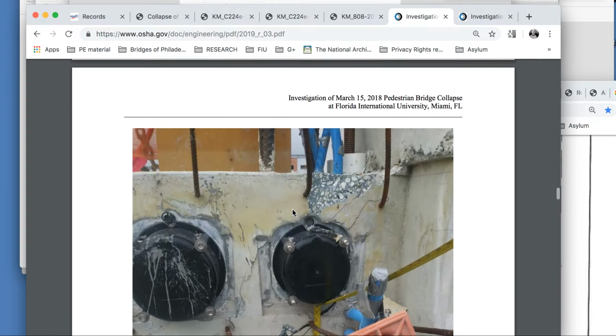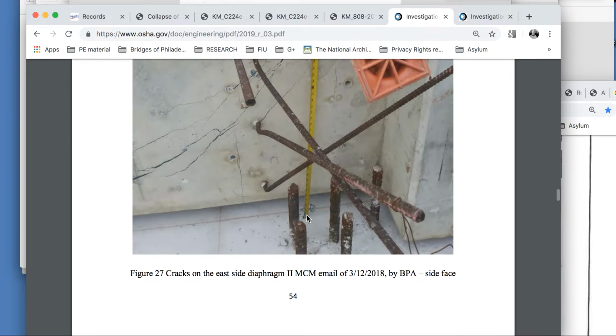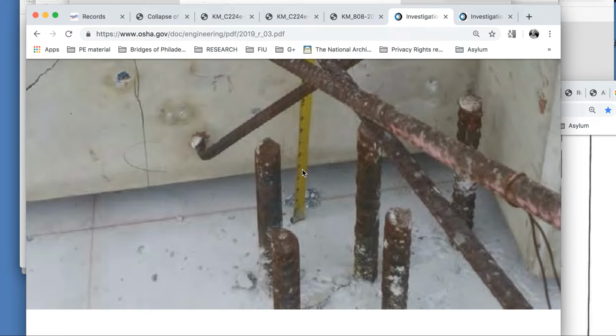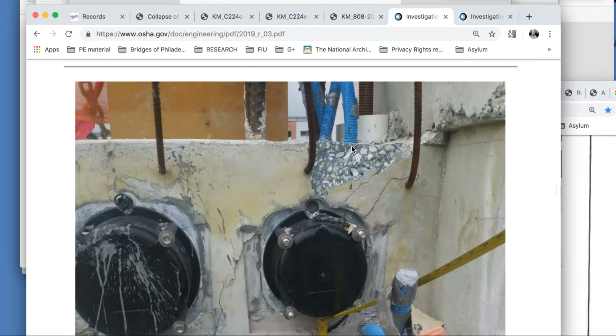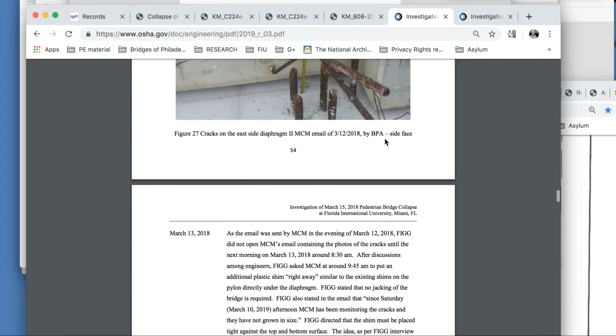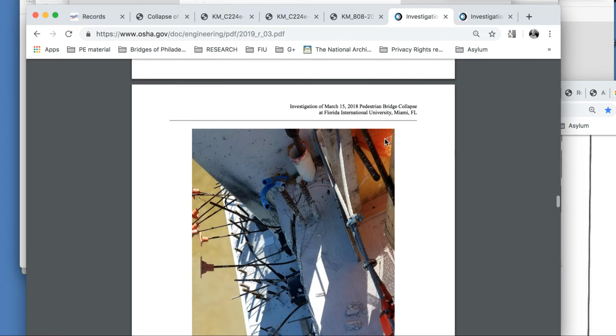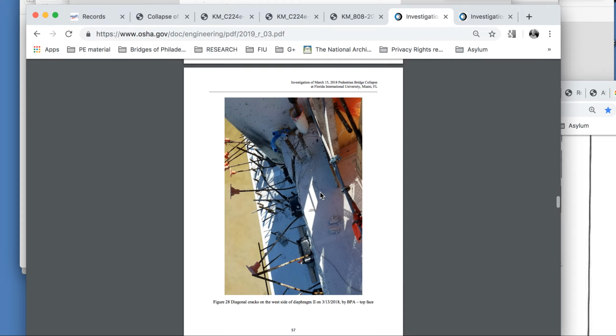It's shearing down and being pulled back by the tension, I believe, in the canopy from the longitudinal cables. This is close to 5 inches, so we're about 1.5 inches of a radius from the bottom end leaning backwards, and that explains a lot more cracking details here. One crack it doesn't really quite explain for me, but I'm still working on that. But again, that explains why it would be high here and the shape we're looking at.